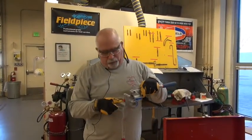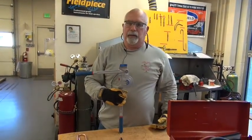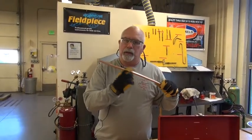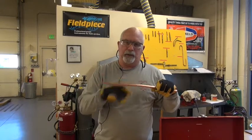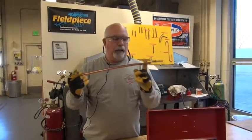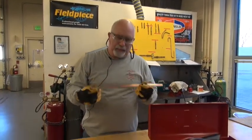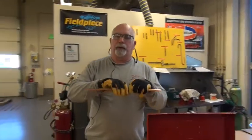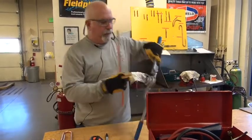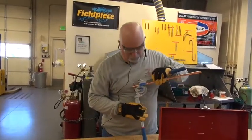We're not making anybody an expert. You don't have to jerk down on this really tight — just firm it up. It works the same way; nothing is that difficult. Mark off your copper tubing. Do the 45 first in the spring bender, then the 90, then straighten it back out. Your marks are already there at two inches and seven inches. Once marked, do your 45 in the spring bender, your 90 in the spring bender, pull it out, lay it flat, and then use the tube bender. If your mark is right there, set it down, line up your zeros, and go to it.